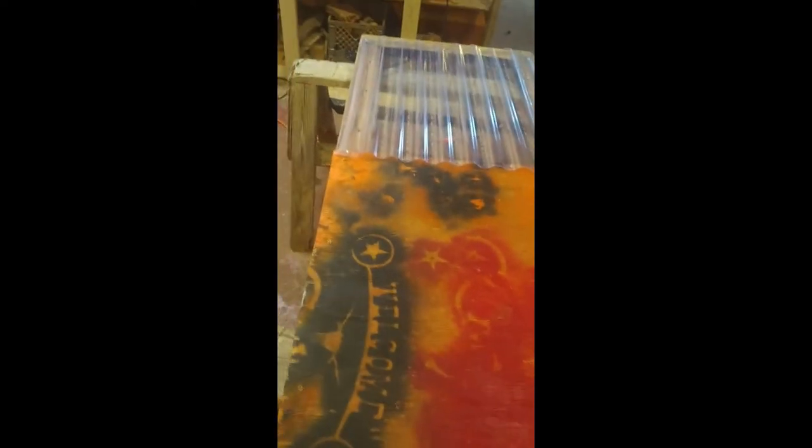We're going to put a piece of plywood across about half — a little over half — the front of the door for a nice solid lower section, and then put a window in the top with plastic. Here we are: a piece of plywood that has obviously been used before — there's an old stencil on it — but that is half our door. The other side is a little smoother, so I'd rather have the unmessed-up corner facing outside. The whole thing's going to get painted anyway. It's all been treated with Thompson's Water Seal. Next step: vinyl corrugated paneling for the window — that should work really well, and no chickens are going to break their way out.